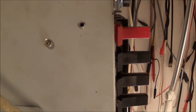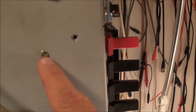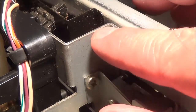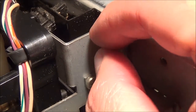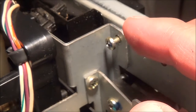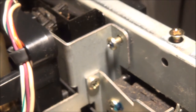It looks like everything's good to go except I forgot one screw right there, and it's coming out now. I did have problems getting this screw out, and looks like I'll have problems with the other one too because they used some kind of Loctite. What I had to do was use a heat gun on it, then hit it with cold spray once it was heated. With an exact-fitting screwdriver it was just enough to break it loose.